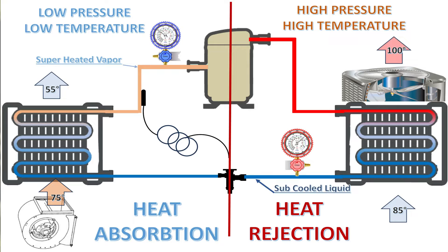That picks up the heat in the air, then transfers that heat out to the compressor, which compresses it into a higher pressure gas. As a higher pressure gas, it releases that heat as it changes from a vapor to a liquid — it condenses in the condenser coil. As that phase change happens, it releases that heat. Then liquid refrigerant comes back to the evap coil, goes through a metering device, and the process is repeated.